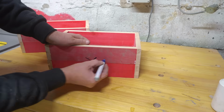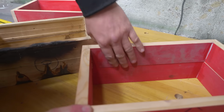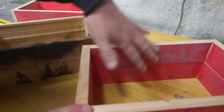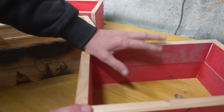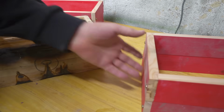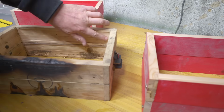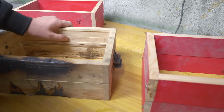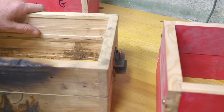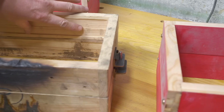These will probably work fine, but with just flat sides like that, you always risk the problem of having a sand drop out. You've finished your whole mold, and just when you pick it up to put it somewhere, the sand slides off the wall and falls. That's why on this, I've got these recesses milled into the sides of the flask. They don't look that great, but it just gives the sand something to tooth into on the sides so you don't get dropouts.